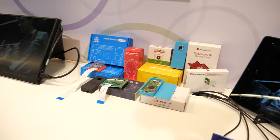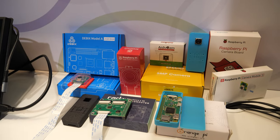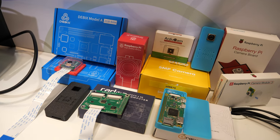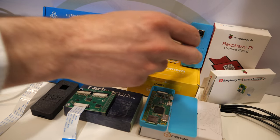There are lots of interesting SOCs that don't necessarily focus on camera support — they may have lots of other interesting features but without an integrated ISP. We're more interested in the ones that do integrate an ISP because that usually gives a more integrated user experience. We have the DEBIX board, based on an NXP i.MX 8M Plus — that's the first SOC in the NXP product line that integrates an ISP. It was a bit of a game changer. We have camera modules from Arducam, OKDO, and Raspberry Pi.